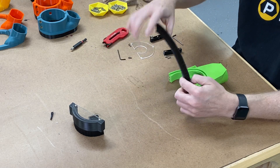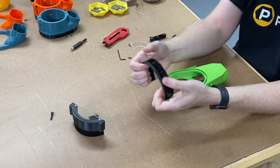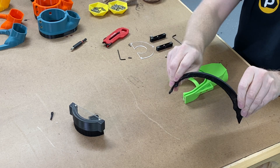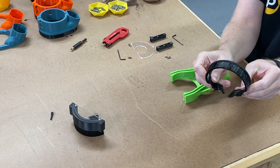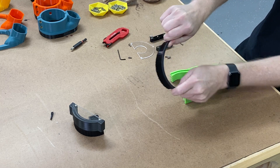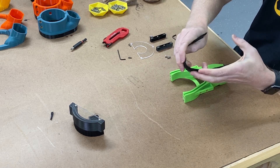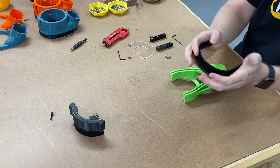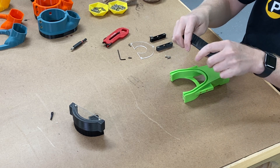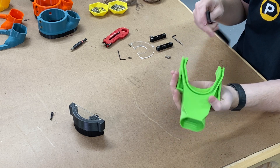For the boot brush, do the exact same thing — it's just a bigger brush. Grab it, twist it, and if it bows out on you, switch to the other side and twist the other way to prevent it from bowing out. This is a 360-degree brush so it goes all the way around your bit as you're cutting. Now that we've got a nice curve on our brush, take the boot, grab it with my left hand, grab the brush in my right, and slide it right in.